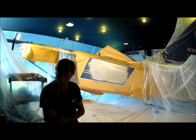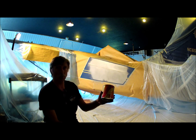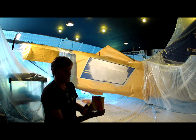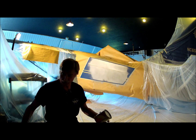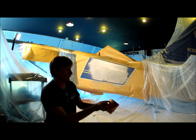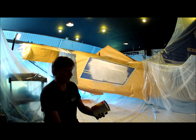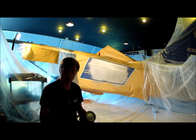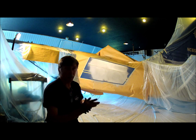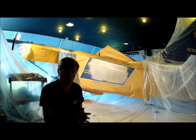Once you've got that situated the way you need it with about two or three coats on there, it's time to come back with poly spray. This is very similar to the poly brush you put on there, except it's not tinted red. I was told there are aluminum oxide pigments in here, but it gives it a silver color. The silver color is to protect from ultraviolet rays and protect the fabric underneath. It also provides the possibility to build up areas where you need to. So that works pretty good.